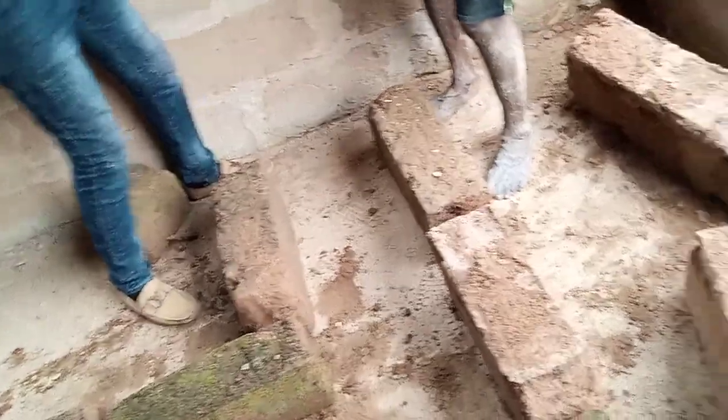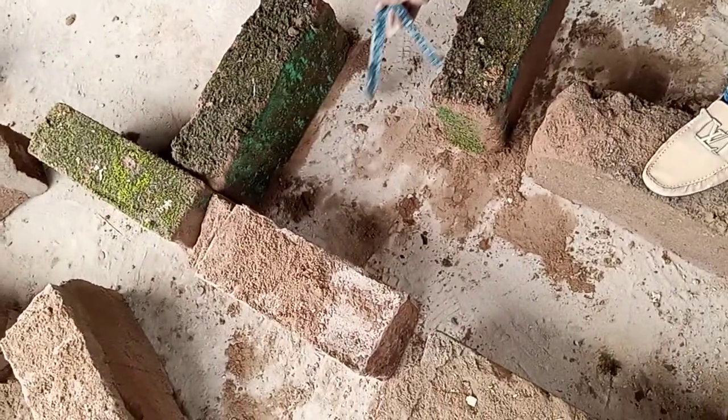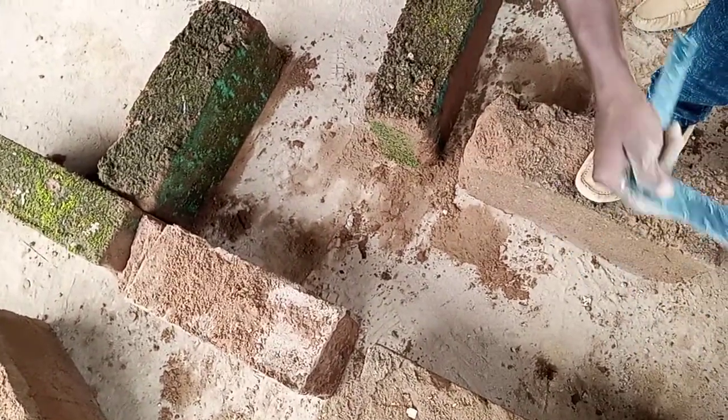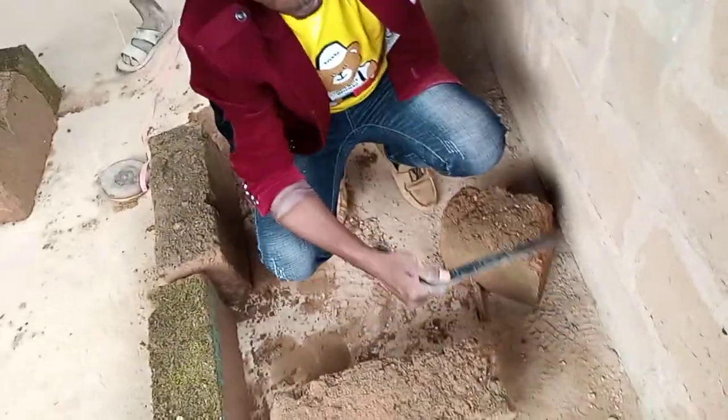Come out so that I'll show you from here. When you put a PVC pipe here, I'm going to put an elbow here, which will bring it down to the downstairs, so that it will go inside the pit. Then this is where it flows. So we understand the mechanism we did here. The thing will flow down from that place to this place, and enter the PVC pipe that will flow down. If we open this place for the droppings to flow through, it will be pouring on the window of the other floor, which we don't want. Therefore, it will be polluting the environment.